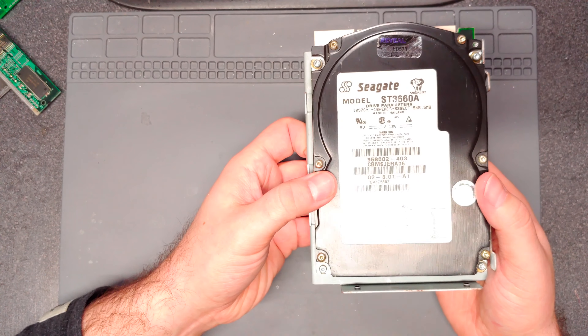As you can see the IPA really didn't help much - the GNS 9330 chip still has tons of corrosion, as well as these three resistors and this array of capacitors and resistors, which might be bad as well. The bottom is the one that's going to be more concerning, because while I've got all of the white corrosion off, there's still all of the green corrosion on various vias, traces, and things like that. This is going to be not a fun repair attempt, and I might not even be able to do it with my skill set.